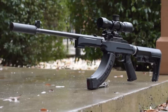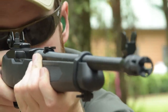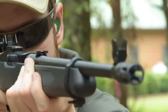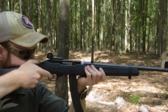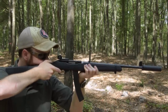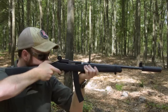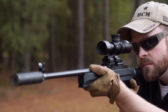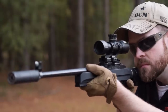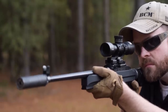With that in mind, let's dive right into part two of the ultimate survival rifle build for the Ruger 10-22 takedown carbine. Let's start with the single most important aspect of any firearm: reliability. I touched on this briefly in part one but not in enough depth. Most advocates of the 10-22 and 22s in general for survival tend to neglect this lackluster trait. In general, rimfire weapons aren't as reliable as their centerfire counterparts, due to a number of factors — the overwhelming majority of which are ammunition-related. The two biggest contributing factors are feeding malfunctions and failure-to-fire issues relating to the primer.